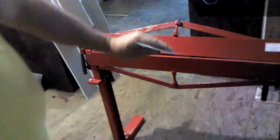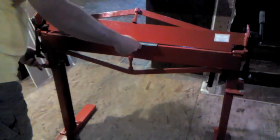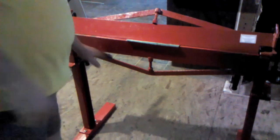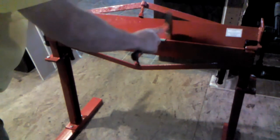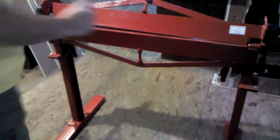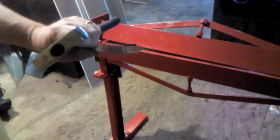As you can see, I have a rough-looking Pittsburgh seam started on this piece of sheet metal with just a brake. The next step is to get this a little bit flatter and make a nicer seam. I'm going to lock that down just off of where it is three layers thick, bend it up just a hair, then take the hammer and tap it back down until it's flat. Now what we should have is a fairly decent Pittsburgh seam built straight on a sheet metal brake.